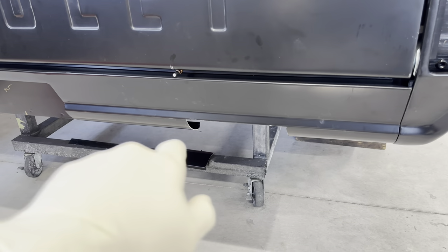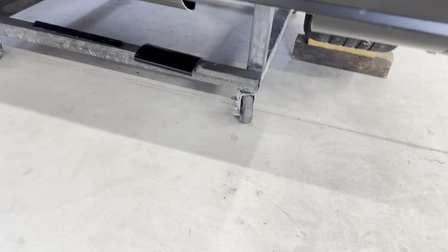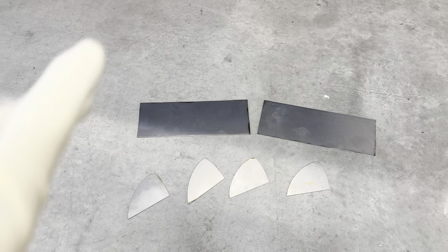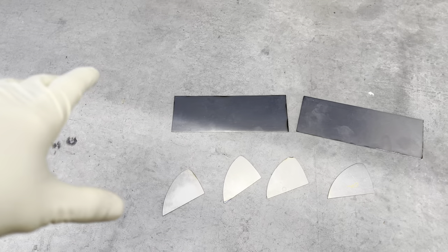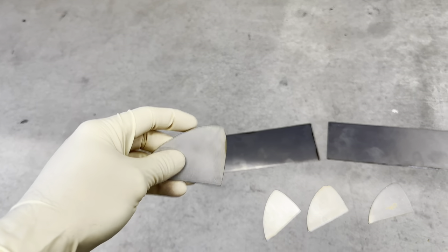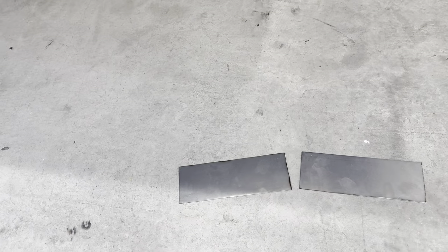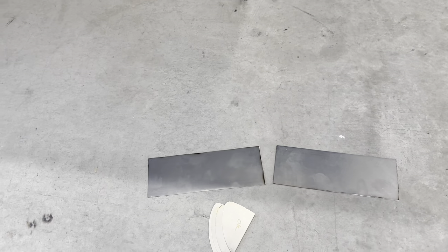Let's get into boxing these outlets where I've cut out for the exhaust tips. I've already gotten my pieces cut out — since this isn't a CNC/plasma table design I've had to cut them by hand. I take a template, mark it on a larger sheet of sheet metal, rough cut with a die grinder close to my mark, then come in with a finishing tool and take it right down to the mark. I'm probably not building space shuttles this way, but I can get all the pieces essentially the same size.